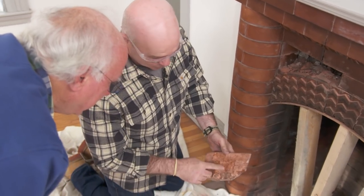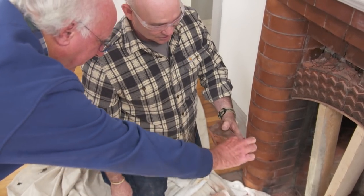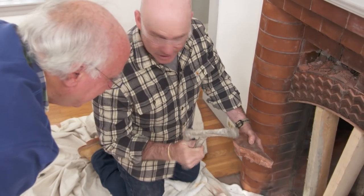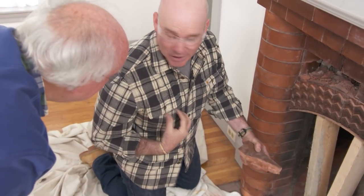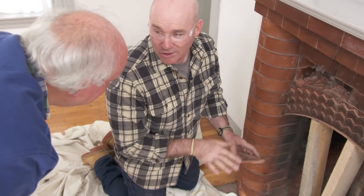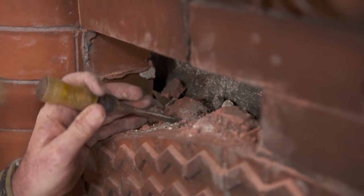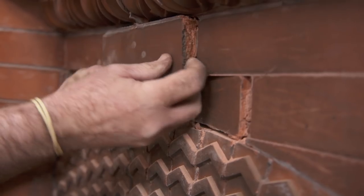More of the same characteristics of the brick hammer — same colored mortar. Look at the thinness of it. Imagine with a hammer, tap tap tap — through experience, I lose that piece three out of four times. It's really, really a hard cut. Now we can go after the remaining brick, but only in the areas that were damaged by settling. I want to keep as much of the fireplace intact as possible.